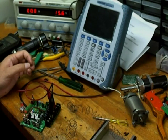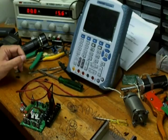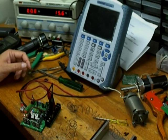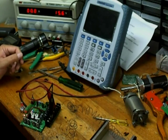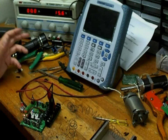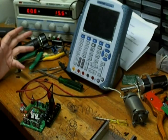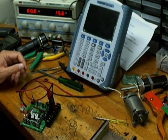When I put together these controllers I really don't like the idea of using fans, because the way I look at it I don't always know where people are going to install these things. I mean I've seen them in trolling motors, virtually any application you can think of — wherever there's a use for a motor controller I've seen them used. In some conditions fans are a really bad idea. So I decided to build something where you've got the choice whether you want heat sinks or not — if your current limit is going to be around 50 amps, you'll be able to run this without a heat sink, no problem.